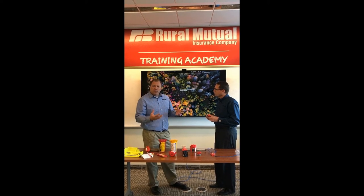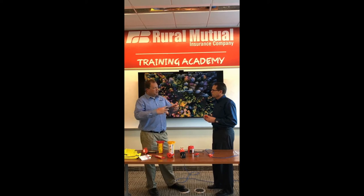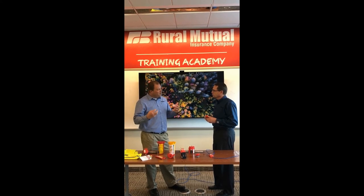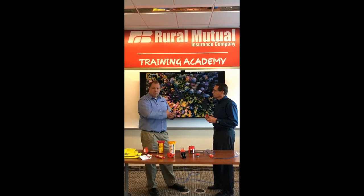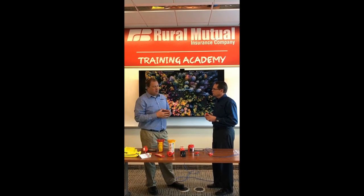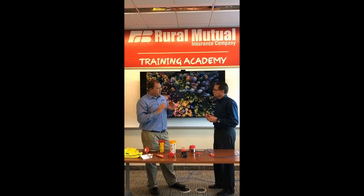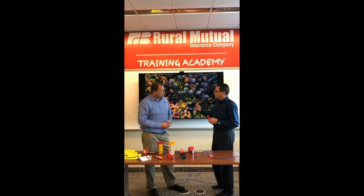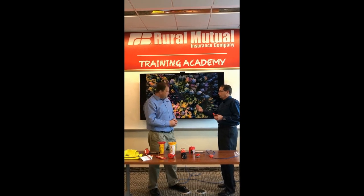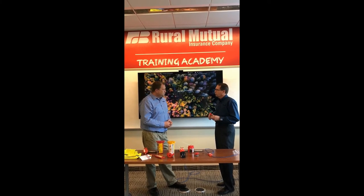We also want to look at things that are under tension, springs, pulleys, things under weight, where once we release tension on something, we don't have an unexpected consequence where that piece of machinery moves or a gear moves and entangles an employee. So we want to go through that entire piece of equipment and make sure all of those pieces of mechanical energy have been dissipated before we start working on it. So basically cycle that piece of equipment through one of its cycles to make sure the stored energy is now released and it is safe to go in and work on that piece of equipment? Exactly.